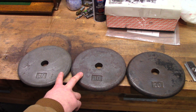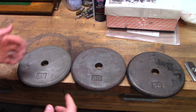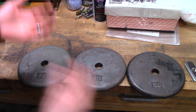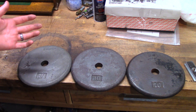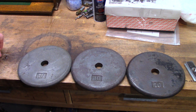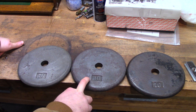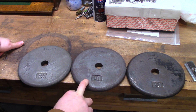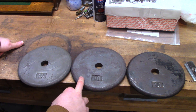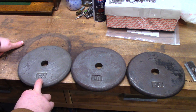In further comparison, I just don't think Electrolysis really holds an edge, because you've got to consider: you need the apparatus, you need a power supply, you need to deal with venting the gases because they're explosive. I live in an old drafty house, so not an issue, but if you're in a modern tight enclosure that might be more of a concern. The only time I could really see this winning big time is for larger parts, because there's no limit to the size of the Electrolysis apparatus you can build. I highly doubt you want to buy 55 gallons of Evapo-Rust, even at 14 bucks a gallon — that adds up.